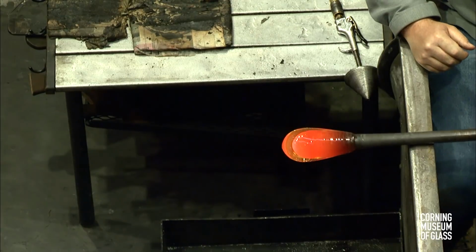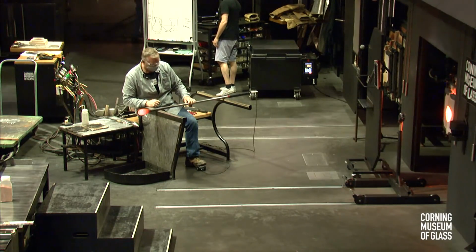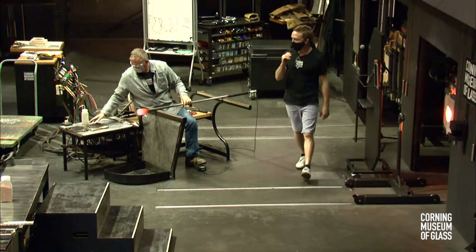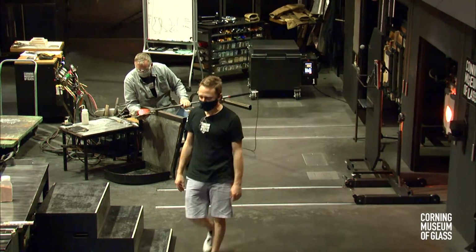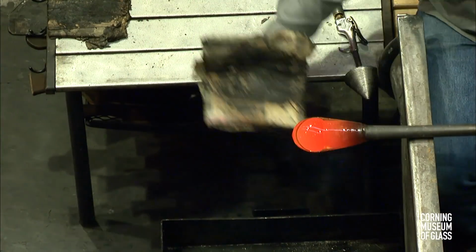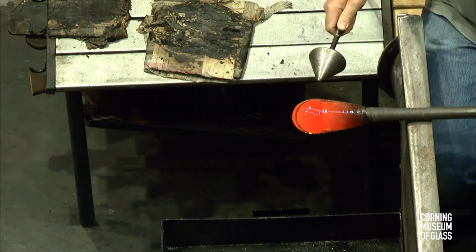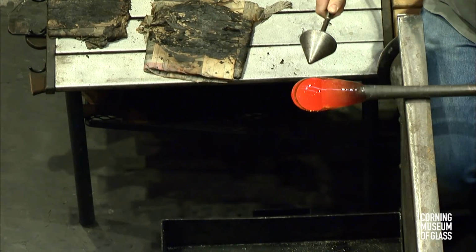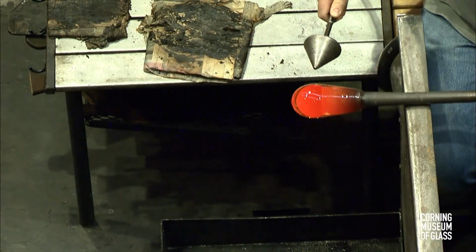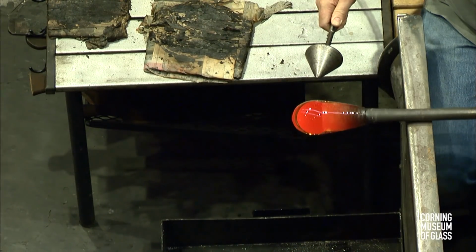If you're watching George right now, he's capped this tube onto the end of the blowpipe. We're using compressed air because we're wearing masks. Now normally what we would do is put our mouth on the mouthpiece of the blowpipe and simply blow through. That is how glass blowing has been done for 2,000 years. But wearing a mask poses some restrictions to that, so we're using compressed air. You all probably can't see it from the seats, but there's a foot pedal in front of him. When he wants air pressure, he just taps that foot pedal. Now there's a regulator on that system, and right now it's at about 2 psi or less, which if you're not familiar with pounds of pressure, that's really, really soft, and it simply doesn't take much. Glass is extremely soft when it's this hot.